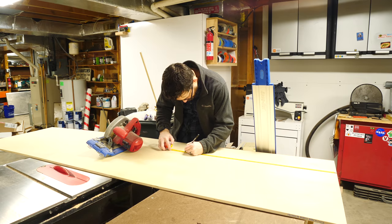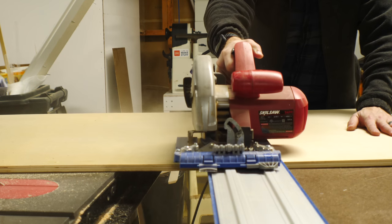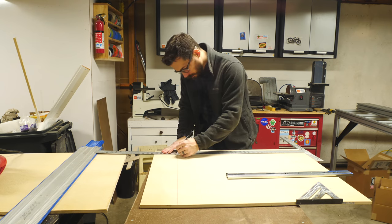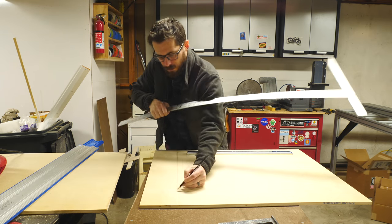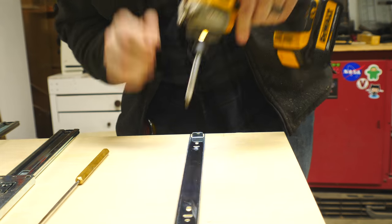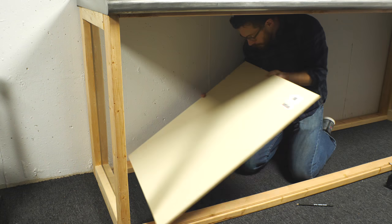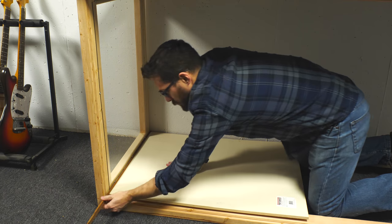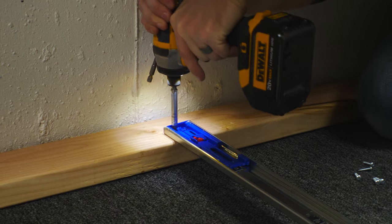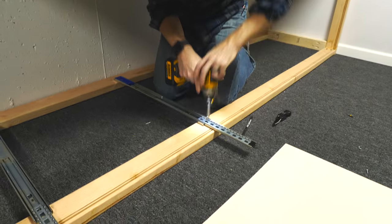Next up, we broke down a full sheet of plywood into some usable sized pieces to make panels to set the 3D printers on. The plan was for these to have drawer slides on the bottom so that the panels could slide out in case we needed to get to the printer. The drawer slides come apart into two pieces and the rails get screwed onto the shelf piece. Then we put the slides back together and added some double-sided tape to hold the bottom pieces against the frame. I set the shelf in place, fully extended it, then drove in some screws to lock it all in.